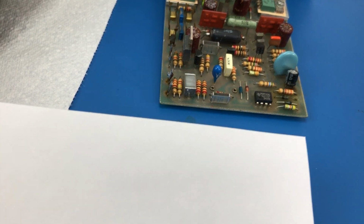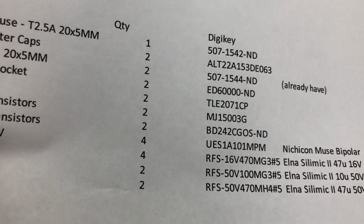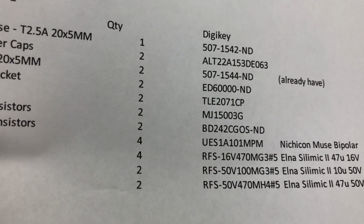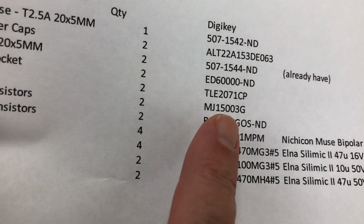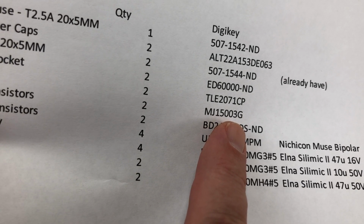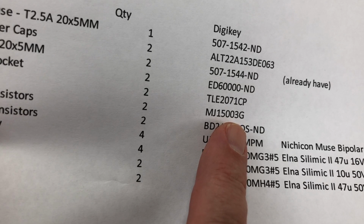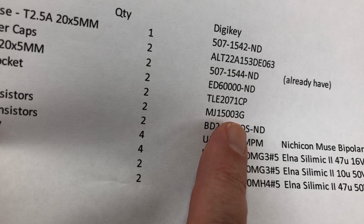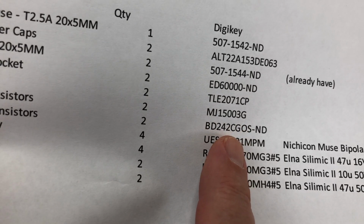So I did some research and found a Quad 405-2 page that indicates that this ON Semiconductor part, MJ15003G, is an equivalent replacement, so I've ordered 2 of those. They were about $11 each. The filter capacitors are about $15 each, so it starts to add up pretty quickly.